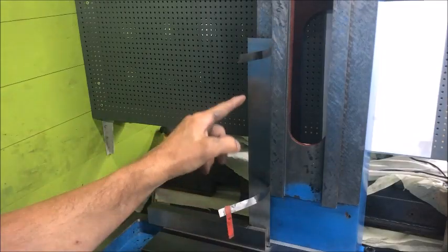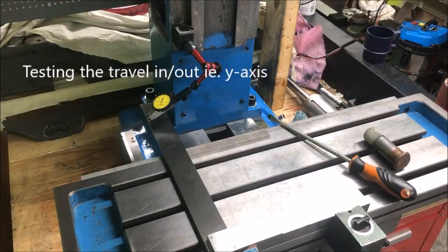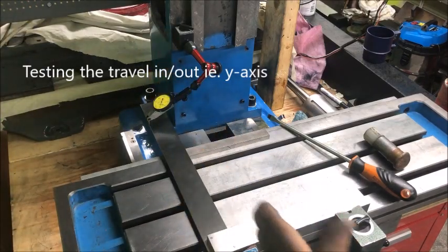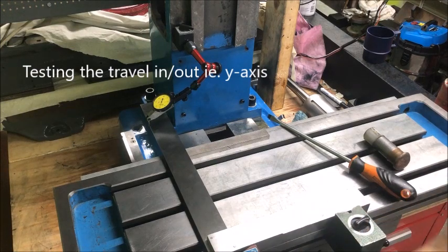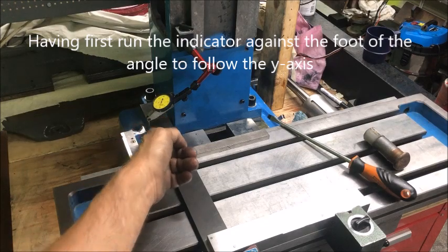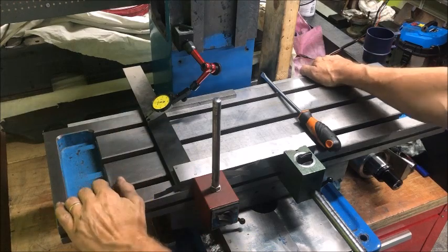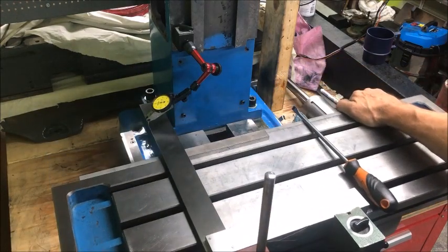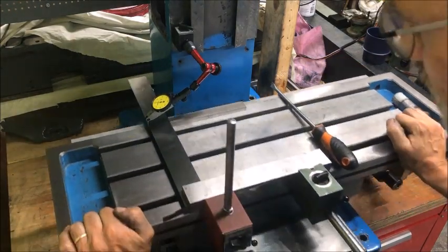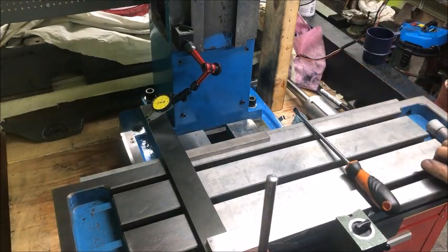At the side here it's four-four, so that's also perfect. Now measuring the transverse alignment and testing this side. I dial it in and that's within one hundredth of a millimeter end to end — quite happy with that.